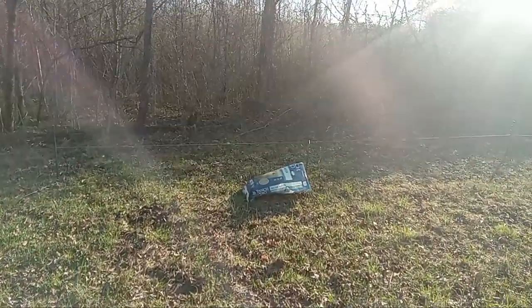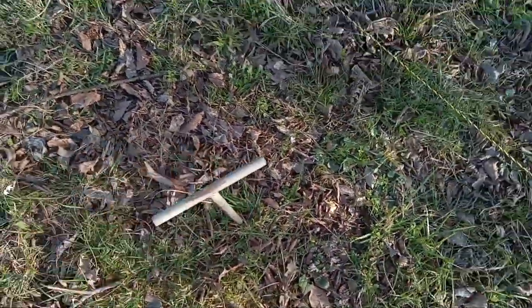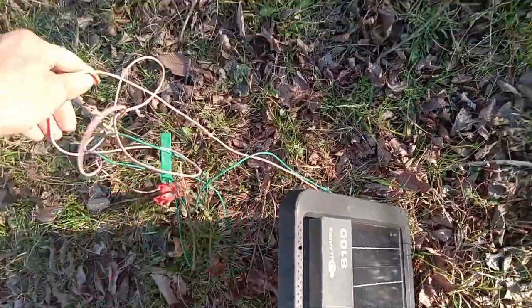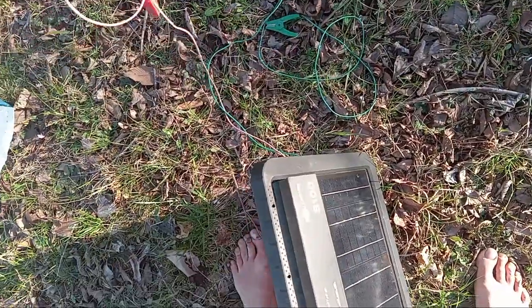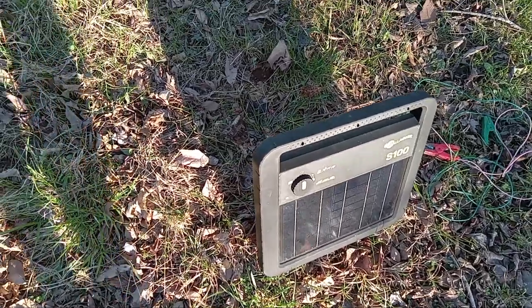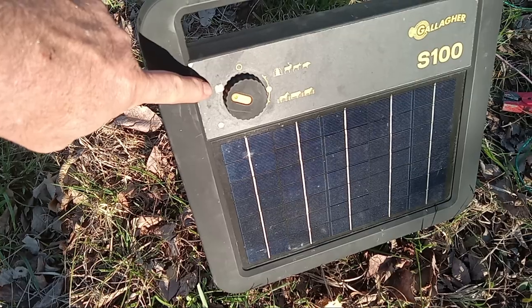There's no risk of electricity shocking and killing anything because it only pulses every few seconds and puts one shock out. But I've been shocked by it a lot. So here's how it works. You push this T-rod in the ground with your hands as far as you can put it, and you set this right here. You got your red wire which is of course your hot wire - that's your hot wire - and you attach the hot wire. See, it's off. There's a lever right here. This right here is off, and this has it not fully charged yet.